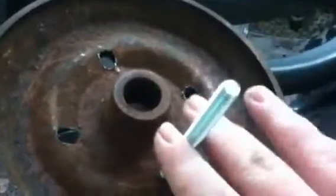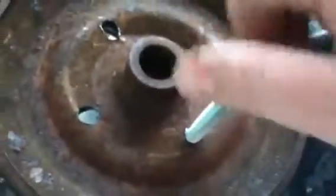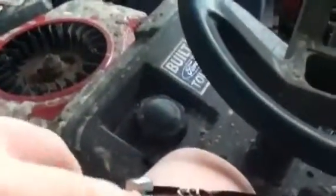I got bolts that were just a little bit too big or too tall, but that's fine. These are 3.5 inch, 5/16 by 18 bolts. You're going to need four of these and three nuts per bolt. Now, I haven't done this, so I'm not sure how well it's going to work. My dad came up with this idea. What you're going to do is take your pulley and put the bolt in, just as I am now. Then you put another nut on however high you want this to be. Let's say you want this high, so you put a nut there. Then you put in another nut underneath that, and that will lock it and keep this from going any further into the flywheel. Once all four are put in, you tighten down this nut until it crushes down to the other nut, and then that levels it.